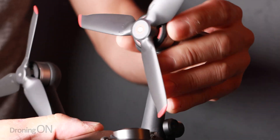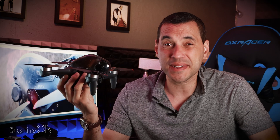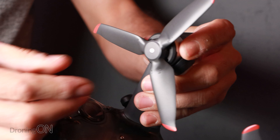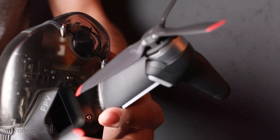This is a tip that also applies to any other drone. Before you fly, always check the props, because these quick release and quick fitment props can become loose. And if they become loose and you take off and start flying and then you lose a prop, return to home is not going to help you — because believe it or not, this can't fly on three props. So just do a very basic test: put the drone down on a table and check that all of the props cannot rotate on the motor. That way you'll know that they're all securely locked in place.